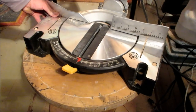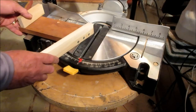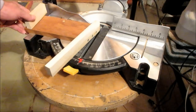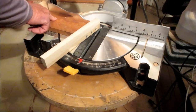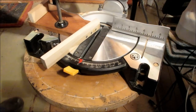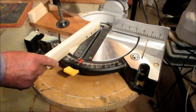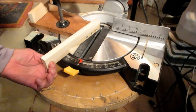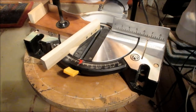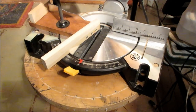I've got the saw set up. This jig fits right here — you can see this part sticking out goes right to the edge there. I can pull it up like so, clamp it down, and it doesn't move. I've also got this piece sticking out past the table so I can put a small clamp, and the saw will pass right next to it. This is all really stable. Now let's cut a neck scarf joint and a headstock scarf joint and see how it works.